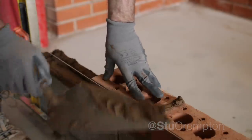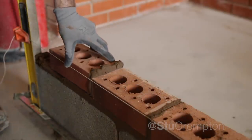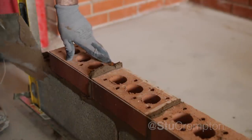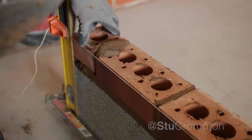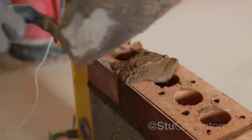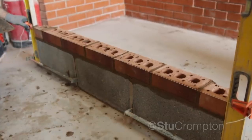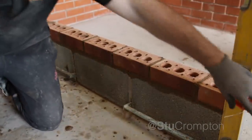Butter the next brick with your excess mortar. Up against the profile, down to the line, on your top. Okay, next gauge mark — bring the line up to that, same with that side.